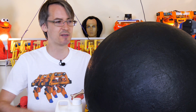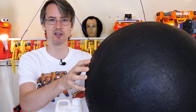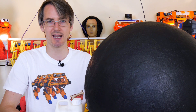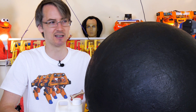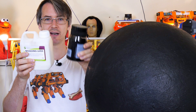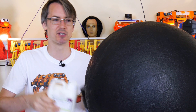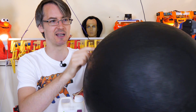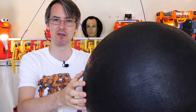The main thing I've done since last time is painting the ball black. This was originally a two-part expanded polystyrene ball, already painted with liquid latex with acrylic paints mixed in to get BB-8's ball pattern. I've now mixed molding latex with black acrylic paint to make quite a thick rubber solution that I've painted several coats on all over. There are some dings and dents in it, but it's quite grippy and should just be fine.